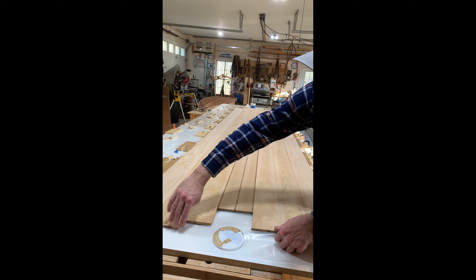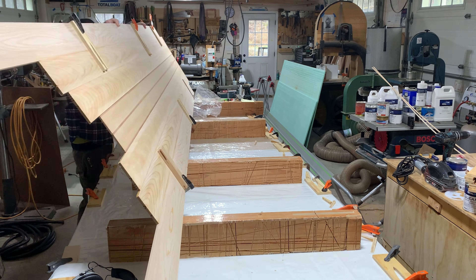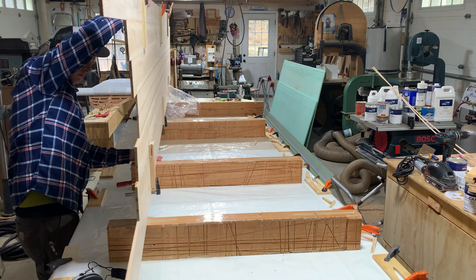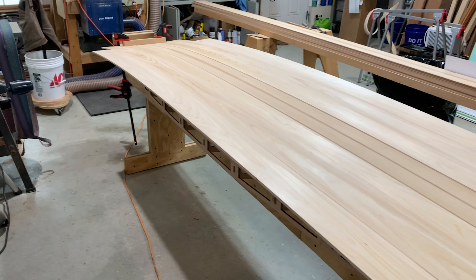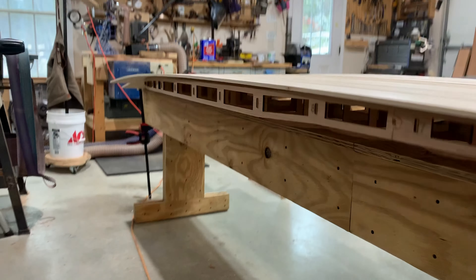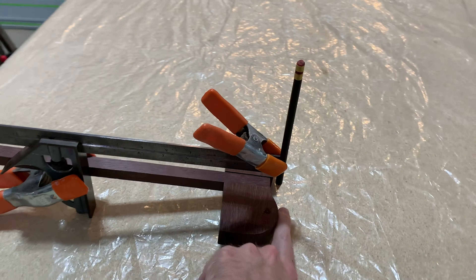Be careful that you don't glue this thing down to whatever you've glued up on — I put plastic down and that worked perfectly. You don't want to break it either when you're moving it around, so I just clamped some battens across it to flip it so I could sand the bottom. What you don't want to do is glue epoxy directly onto that shiny Titebond III — you want to clean that up so it's just raw wood again underneath. And now we're ready to glue it onto the frames. This is just a little trick for reaching around and referencing the actual board rails with the deck, so I don't have so much extra wood in the way.